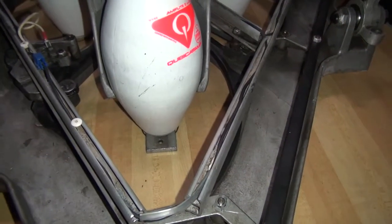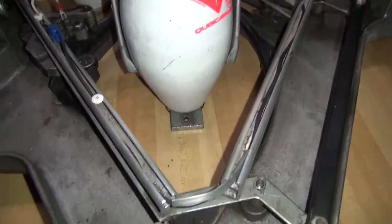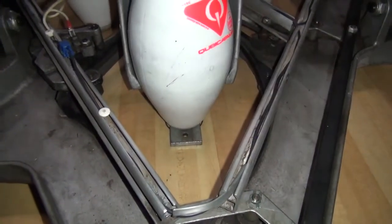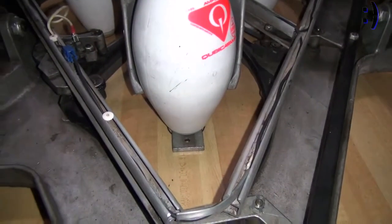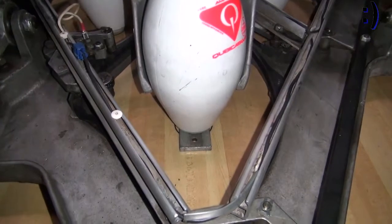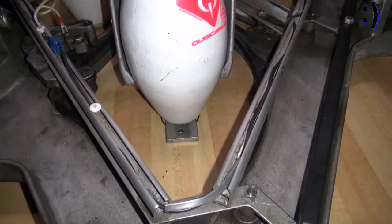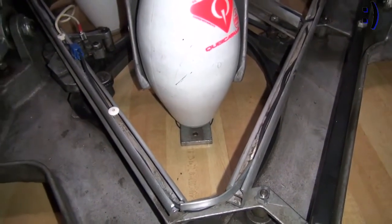So this step will set the yoke timing. What you do is get my favorite gauge, place it on the number 1 pin spot. Continue cranking the table forward in spotting and stop when the head pin is on the gauge. If everything else is right, this will put all the pins about 5/16 of an inch off of the pin deck. Now you can set the timing of the yoke.